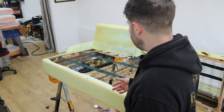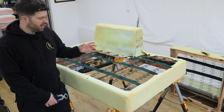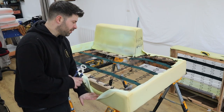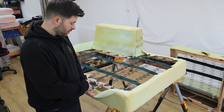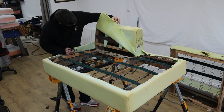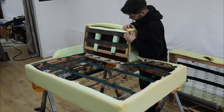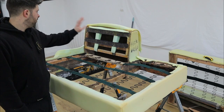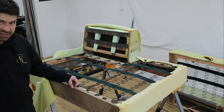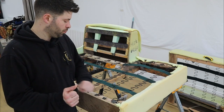We've got quite a bit of work to do here. As you can see, it's sprung — springs are okay, that's good. But the way this frame has been made is not. Like I said, it was made in China. There is hardwood, but it's not actually on the front of the frame — it's an MDF ply frame with hardwood stuck onto the fronts. So there's no wood on the front edge here. You can't put springs into MDF or ply because they'll just pop out — it's not strong enough. So what they've done is put a strip of hardwood on the front, put the springs on there, and done the same all the way around.